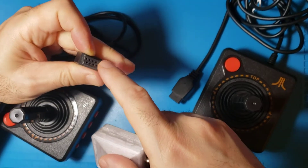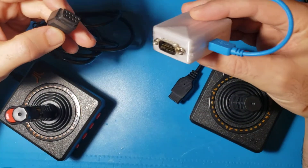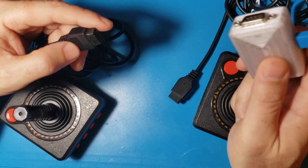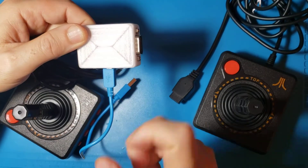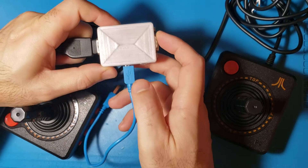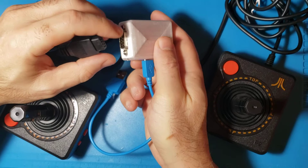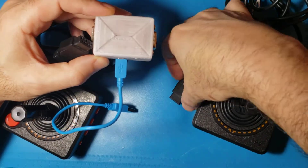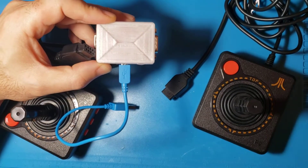They all had this 9-pin adapter and I decided to try to use them. I wanted to play some of the older games with the true action of these joysticks to have some nostalgia, so I decided to create this adapter using a microcontroller. It'll basically take inputs from the joystick, convert them to signals that the computer can understand through the USB device, and your PC or Raspberry Pi will see your joysticks as game pads.